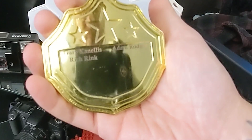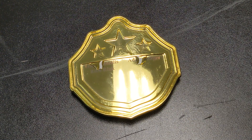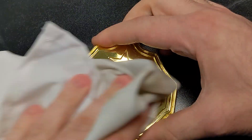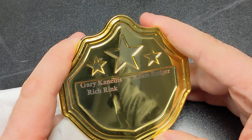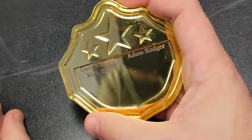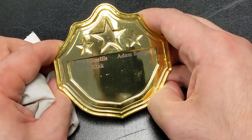The way I'm looking at it, it looks pretty good. So here's our less-than-ideal material — I'm just going to give it a drop or two of 3-in-1 oil and grab our nylon cloth napkin and rub it in. That'll even out the tone of the engravings a little bit. I can't stress enough, this is not a good material to be engraving — we're doing the best we can with a crappy situation. That looks pretty good though. I definitely think the customer is going to be happy with it. He knows this is cheap stuff. This is probably about as good as we could hope for. That's how you deal with this metal — it can be a little rowdy, but it's definitely workable.